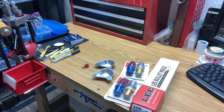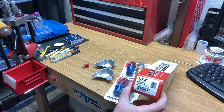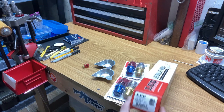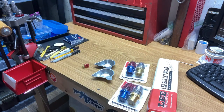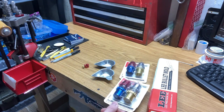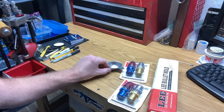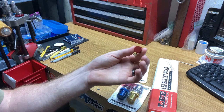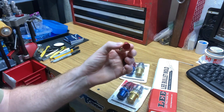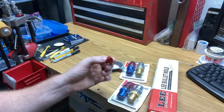Some of the other stuff I picked up was a Lee .45 caliber mold — I've got a family member with a pistol in that caliber, so I thought I'd go ahead and get this mold. It's the .452 200 grain round flat. I also picked up some breech lock bushings — these are my favorites for the breech lock pro press, a lot better than the standard bushings. Picked up a couple powder pans since I jump back and forth between two scales. And I've been wanting one of these — it's a little anvil for the Hornady comparator set that clamps onto your calipers. I've been playing with it and it's well worth it. It sets the case really flat and it's a lot easier to measure.